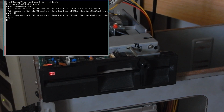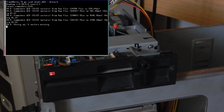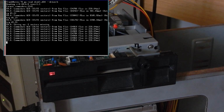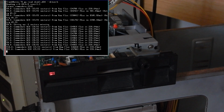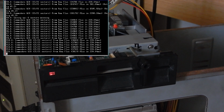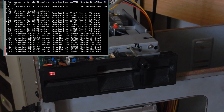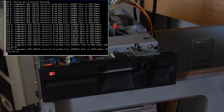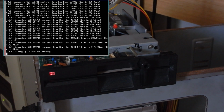Track 1 seems to have a few unreadable sectors. That may well be the case on a 40 years old floppy disk. However, most of the rest of this disk is being decoded correctly. At this stage, I'm not worried about any alignment issue. That will be the last thing if and when everything else works. I only wanted to be sure this drive has no evident faults.